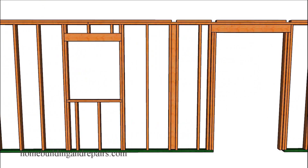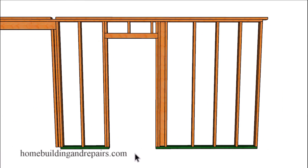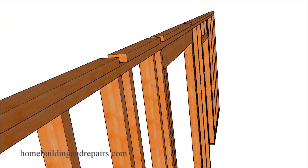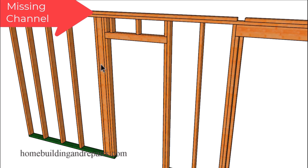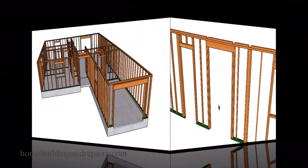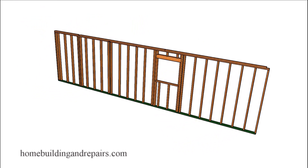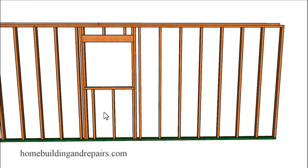Here's our bedroom window at the front of the house, the entryway to the porch, a beam supporting the roof trusses or roof rafters, the garage door, and the entry from the garage into the house. Looking at the other side, the backing is going to be a flat 2x4 that only needs to be on the side where it connects to the other wall. These trimmers sit on the other framing plate so we can run the framing plate through — and there are areas with no 2x4s because we'll be installing two of them to support the porch beam. You can always move your windows over if you're looking to save a few studs.